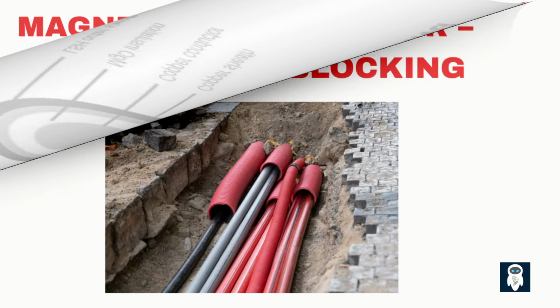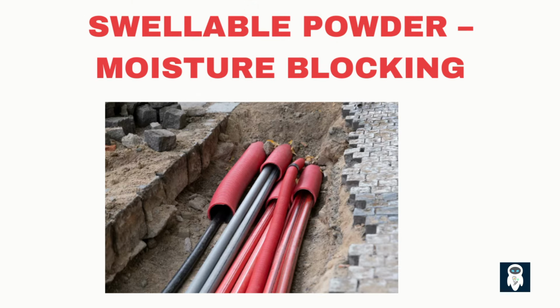When cables are buried underground or run through wet areas, moisture can seep in and cause corrosion, short circuits, and breakdowns. This is where swellable powder comes in. Also known as water-blocking powder, this material absorbs moisture and swells, turning into a gel-like barrier that blocks water from traveling down the cable.